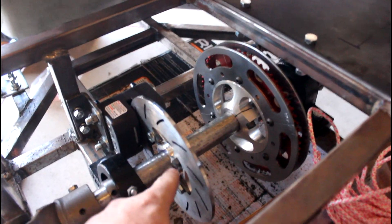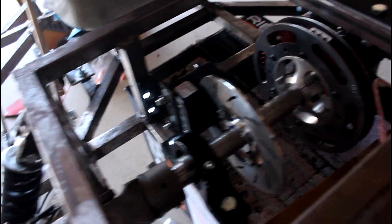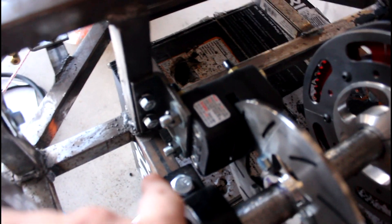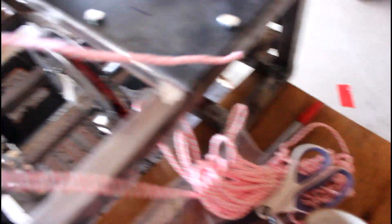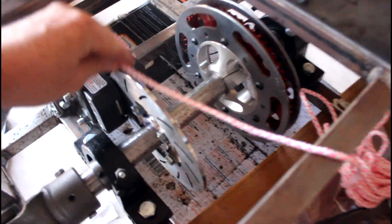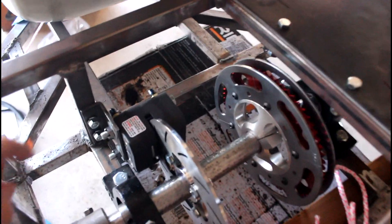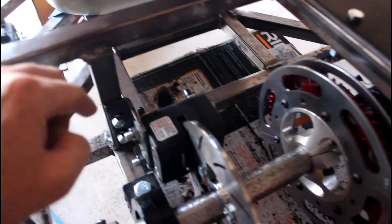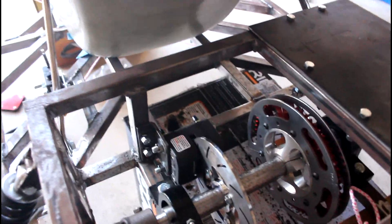Among the parts I got in the mail were the brake rotor, brake hub, brake caliper, and master cylinder. I got an L-bracket from the local hardware store, modified it to mount the caliper, and used string to help with caliper spacing — I wrapped the string around the caliper to make sure the rotor doesn't sit too far in and start eating away at the inside of the caliper. Once I did that I got a vertical piece of tubing, welded some one-inch flat stock to it to bring the caliper closer in, drilled holes through it and through the mounting plate.